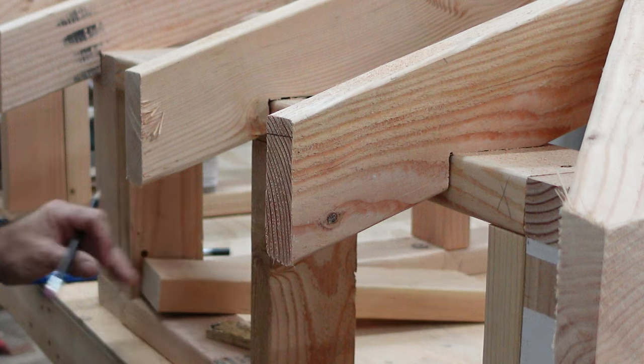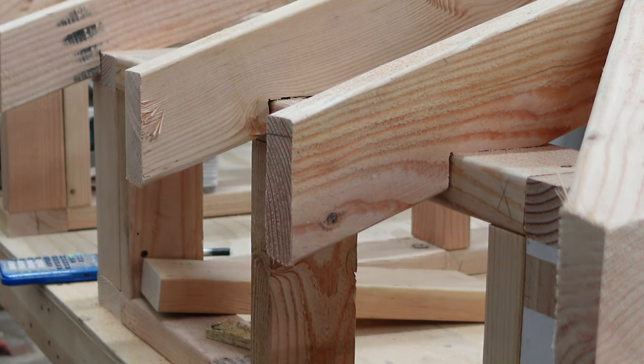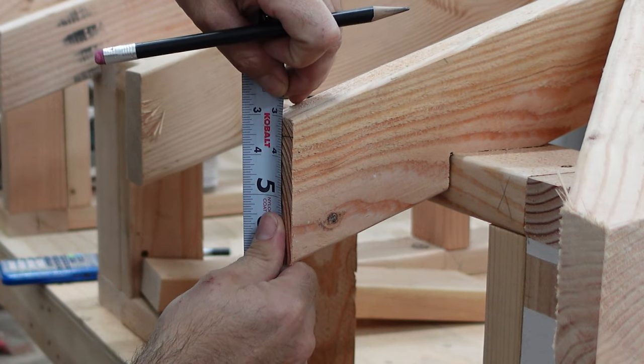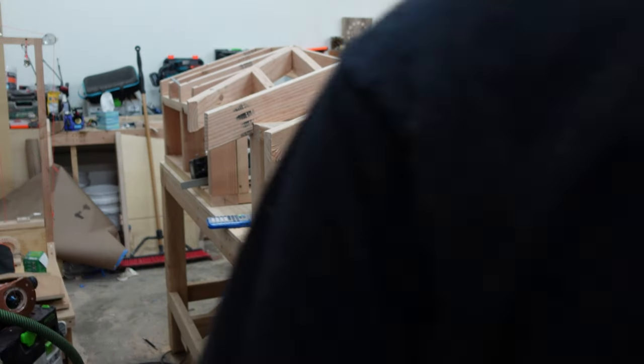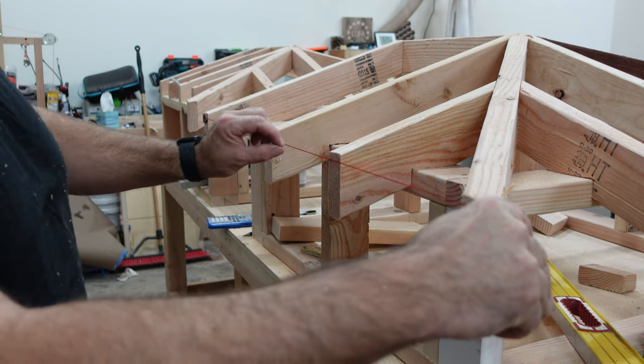This is the height I need all my sub fascia to be. I take this new measurement and mark the tails of the rafters on each end as I did for the plumb cuts, and snap a line across all of the rafter tails. Now if you had a really long building, I wouldn't try to snap the line all the way across in one go — I would mark down on the ends of the tails in increments of about 20 feet and snap each of those separately.